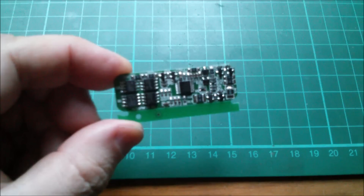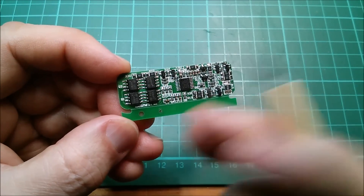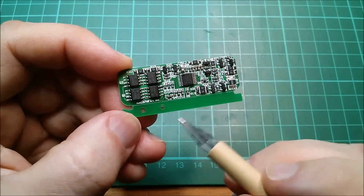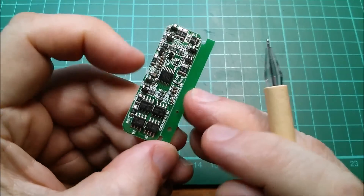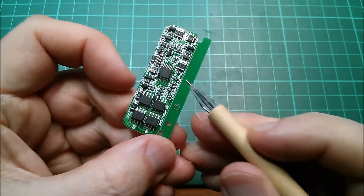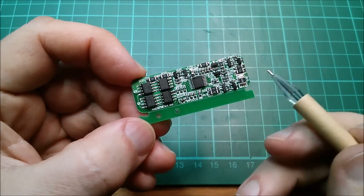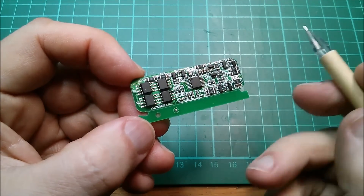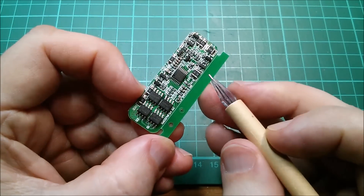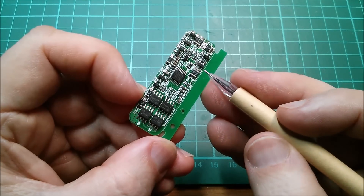I had to abandon natural daylight and go for some overhead lights — the color is a bit nasty and there's a hot spot, but anyway. We have a controller chip here — it says it's an 8254AA. There are four big MOSFETs here, presumably for cutoff if the pack voltage falls too low or drifts too high during charge. There are a lot of SOT-23 devices marked 431 — I assume that's a TL431 voltage reference. There are four of them and I've got a feeling this is a 4S BMS.